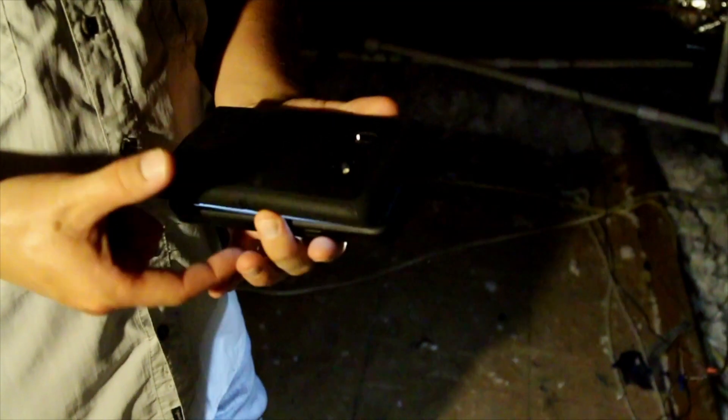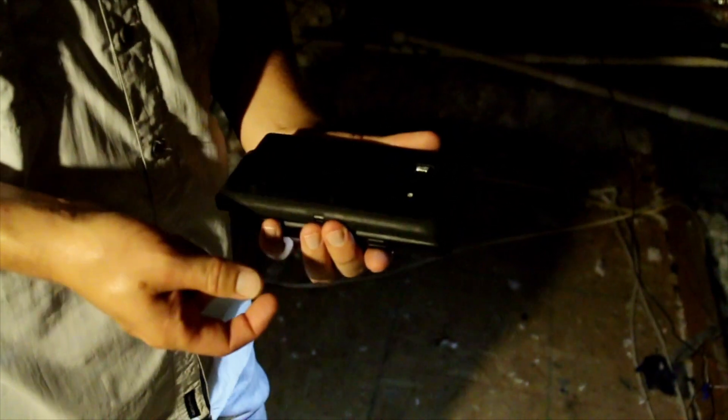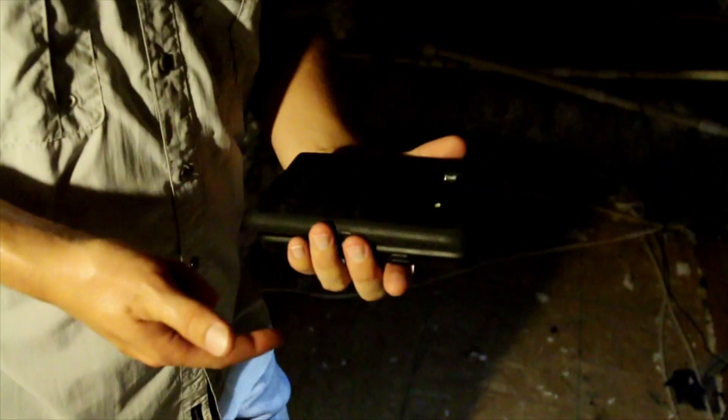If we don't tie into the rafters, we're really just screwing straight through the decking and it's kind of loose. So we're going straight into the rafter underneath the decking — the rafter runs like this and it's going to tighten up and create a very tight installation site. So we don't have the problem of leaking; we're going straight into the rafters. It's a very tight install, not to mention the flashing is very secure as well.